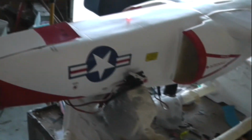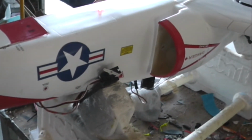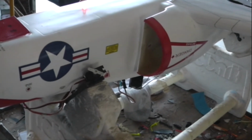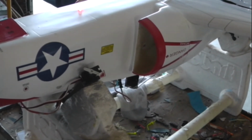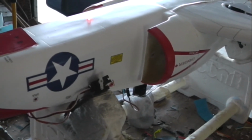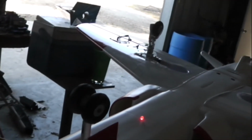Now, as you'll see, the servo triggers when I flip the landing gear switch, which would equal opening the door, and then the gear will wait and follow up. Okay, there's the gear, and now there is the sequencer, and then as you see, the gear followed precisely right as it should. Now there's no servo.